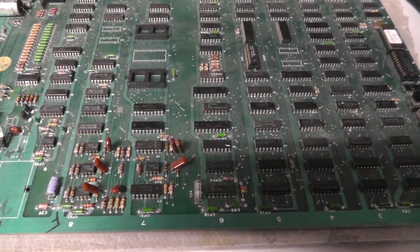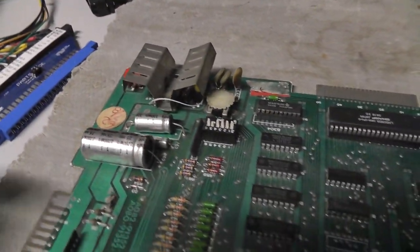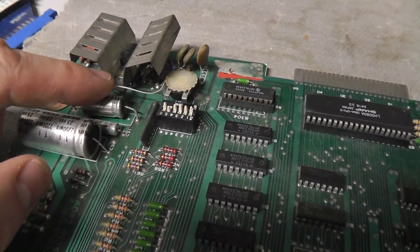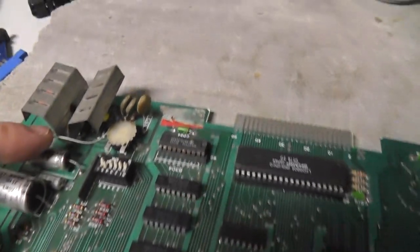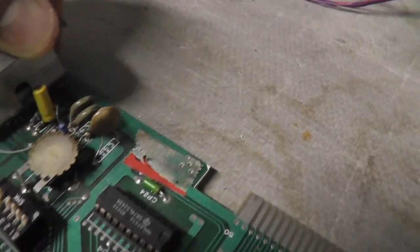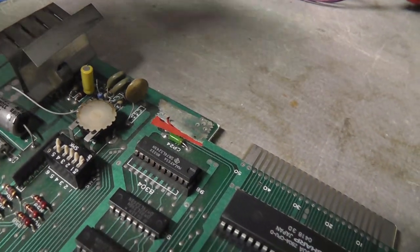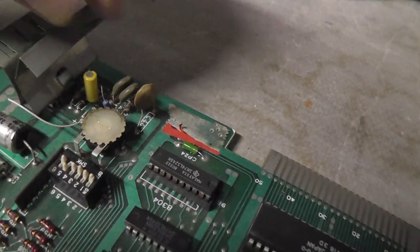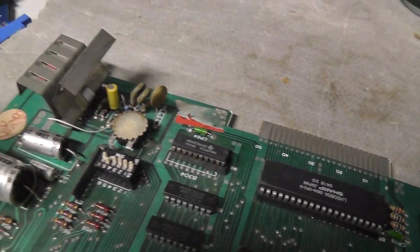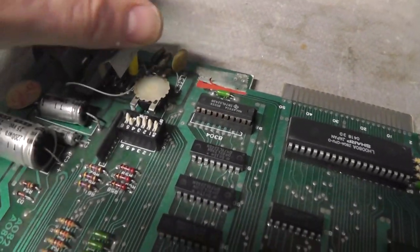Just focused in there — there's a jumper wire on the audio amp which is kind of weird. It does look like something was done to this before. There's an electrolytic cap and a couple capacitors tied together. I'm not sure if there's some audio modification going on there — I might have to research that because it's kind of interesting.